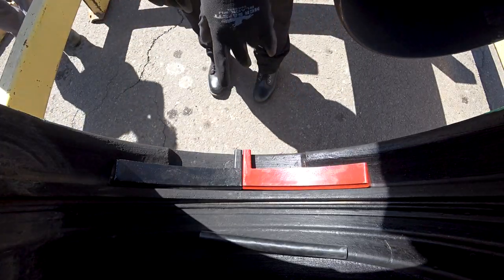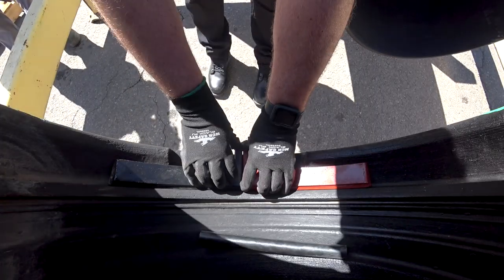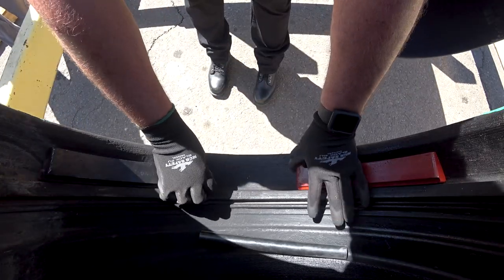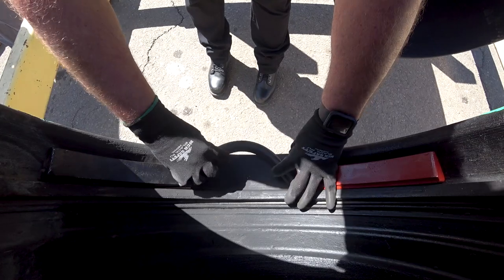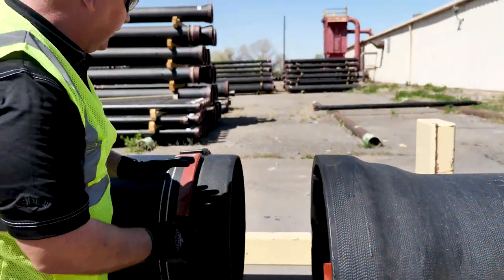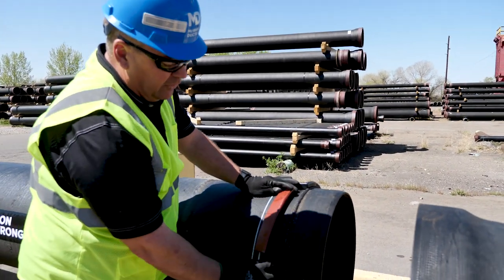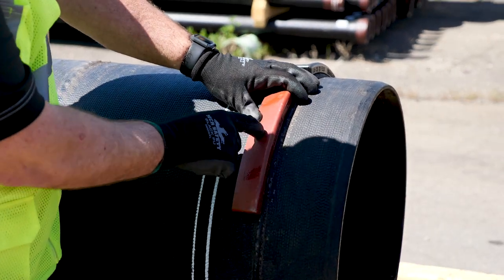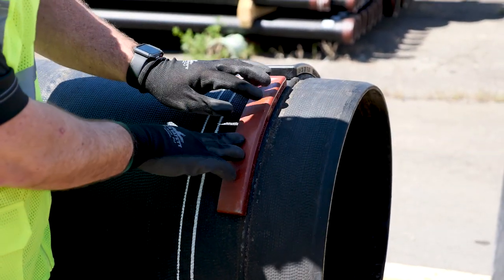You've got a left hand and right hand lock that would go into the slot of the bell. When your pipe goes home, your left hand and right hand separate, and you've got a rubber piece that keeps them separated. The bead on this spigot will engage the locks as shown here. These will be in the top slot of the bell.